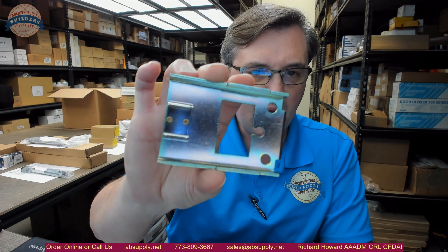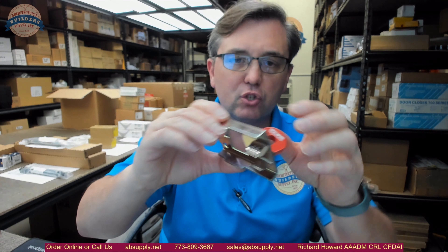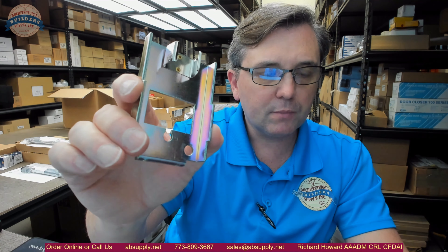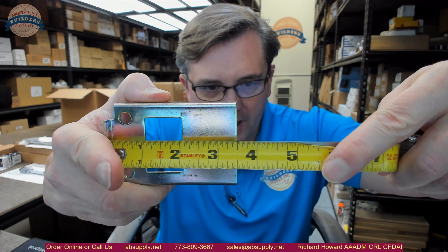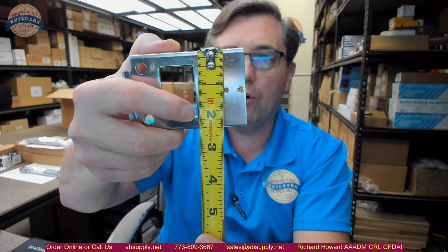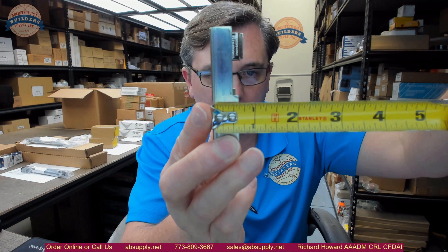This features a battery clip on it as well. This video is to serve as visual evidence and dimensional evidence of the item. So here is the visual evidence. Zinc dichromate plated steel. Dimensionally, overall length is about 3 1/2 inch, with an overall height right at about 2 5/16ths, and an overall depth of about 5/8ths of an inch.